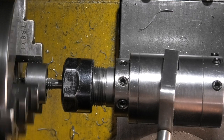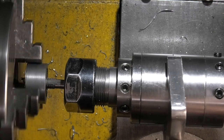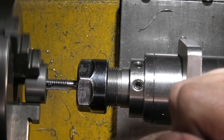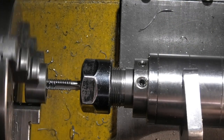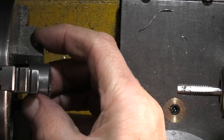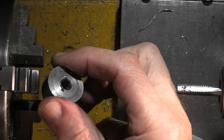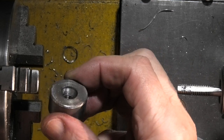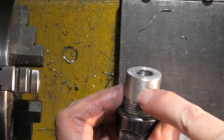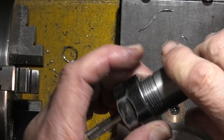I'll tighten up — it's cutting. Put a bit of oil on the tap. That's going in, just come out the other side. Stop it, reverse it. That's cut a thread all the way through. You can see where the grub screw has marked the tap holder, so what I could do is just machine a small flat on each one of those if it starts to twist.